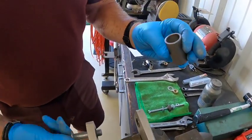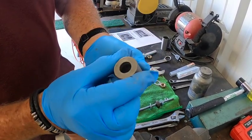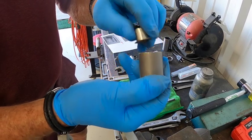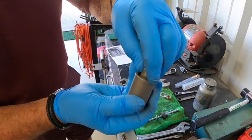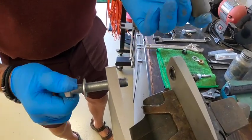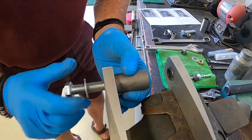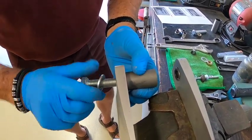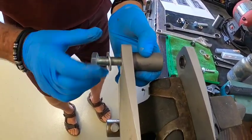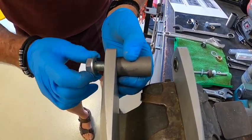This is also an adapter. You'll notice it's got a larger hole on one end and a smaller hole on the other. This is so it'll clear the bushing as you extract it, because the bushing needs clearance — that's what that large hole is for. Put this on with the large hole first so it clears the bushing. Keep threading the bolt through.